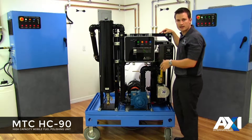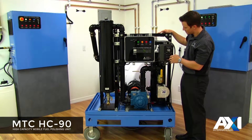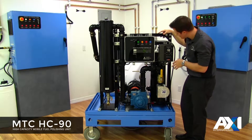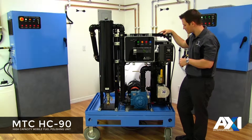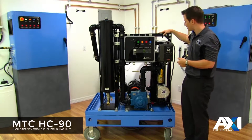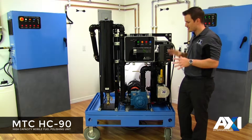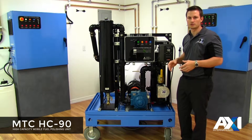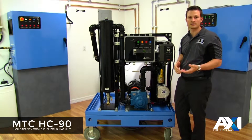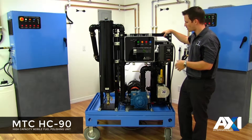Keep it in off mode at this time until you're actually ready to run. You'll want to move over to your variable frequency drive at that point and turn the dial down to around 6 to 10 hertz. You'll want to start the unit at a slow speed and work its way up to the highest flow rate. We typically don't recommend going in auto mode. You'll want to stay by the unit and make sure there are no issues, as spilling at 90 GPM can be a big problem and a big mess.